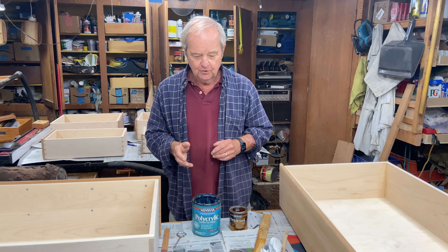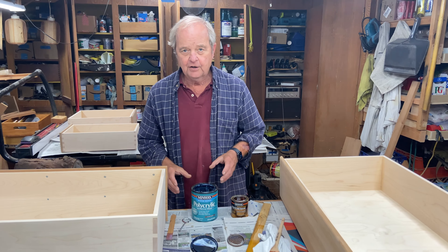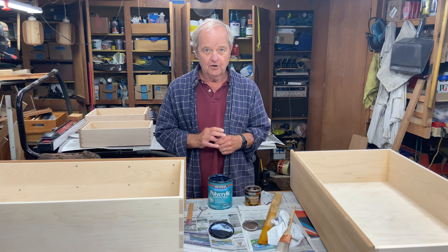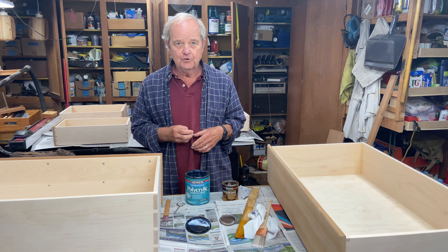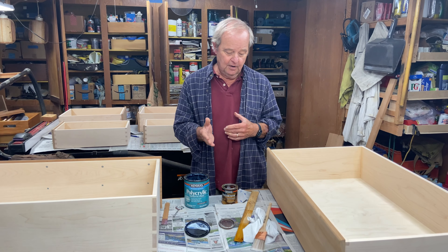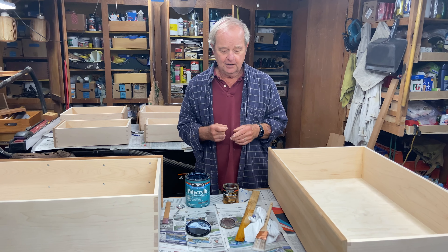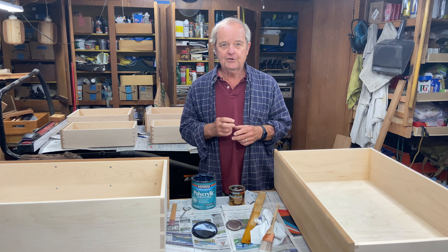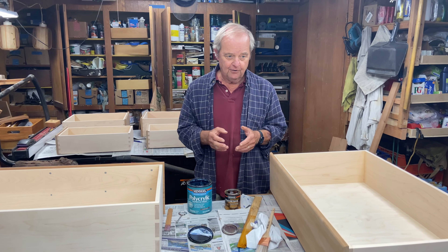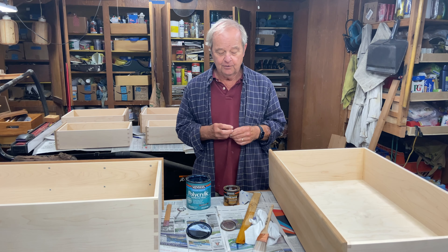What is the difference and why do you want to use one over the other? First of all, the polycrylic is non-volatile and non-toxic — it's water-based, so you can use it in an enclosed room and you don't have to worry about inhaling the vapors, and it's not flammable. The polyurethane, on the other hand, being an oil-based product, can be harmful — the vapors can be harmful if you're in a closed room and don't ventilate it properly, so you want to be careful about that. You can wear a respirator or just keep your work area well ventilated.